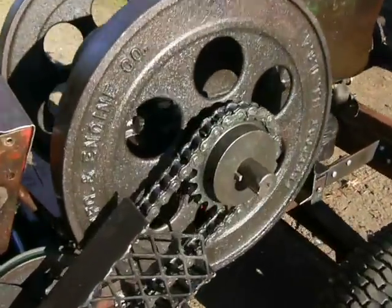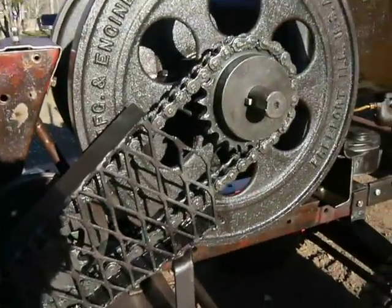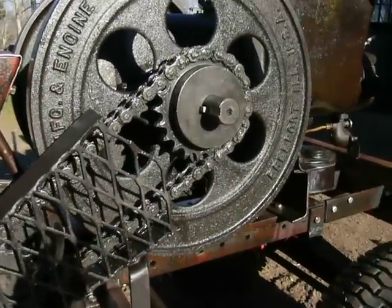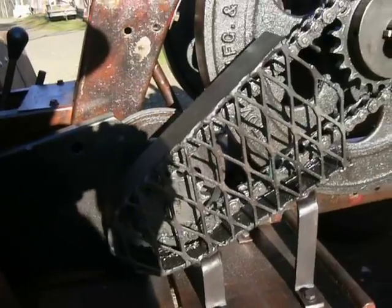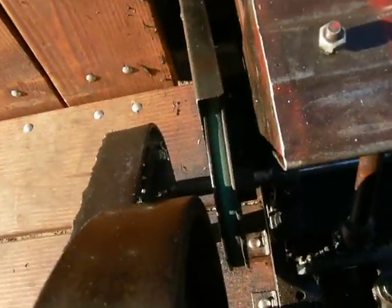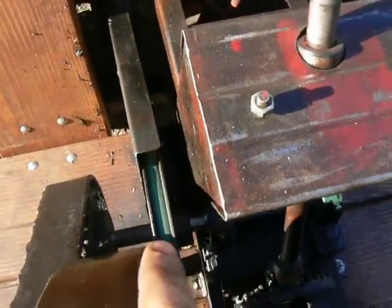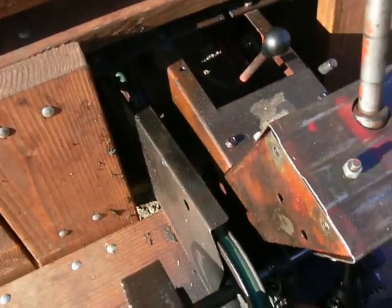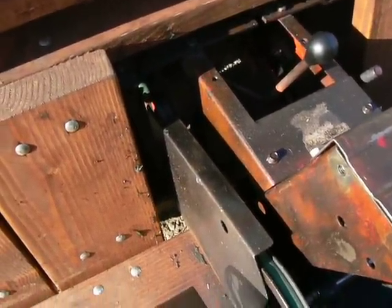The main drive off the engine is a three-quarter pitch roller chain. There's a big sprocket and a smaller one, and since this engine only runs at 500 RPM, I had to speed everything up a little bit. The three-quarter pitch chain goes onto a jack shaft mounted on two pillow block bearings, and that goes to a V-belt — the rest is just the standard stock V-belt drive system that was on the tractor initially, with an idler pulley for a clutch or belt tensioner.